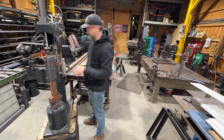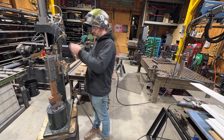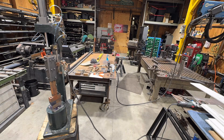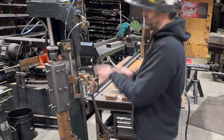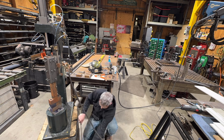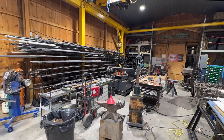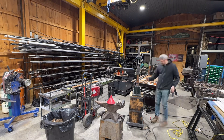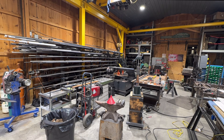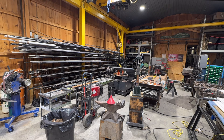On to the hammer to install these parts. I identified where I wanted the boss to be and ground the paint off so I could tack it into place temporarily. I didn't fully weld anything because I wanted to make sure that all of the geometry of this treadle linkage worked out correctly — I had worked it out in CAD, but you never know until you try it for real. So everything was just tacked into place to begin with. Then I grabbed some metal off the rack and made the longer part of the linkage.